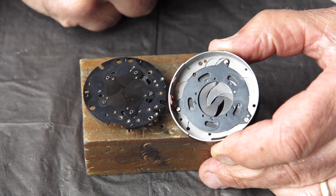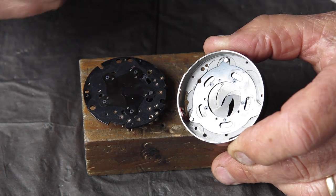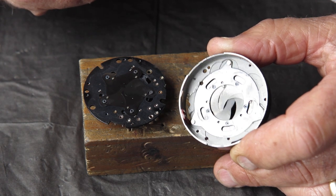It's not sufficient - it's not a good way to fix a shutter. A shutter needs to be disassembled and cleaned properly. All you tend to do when you dab at blades with solvent on a cotton bud is shift the oil from one spot to another.